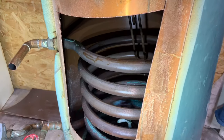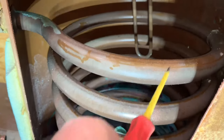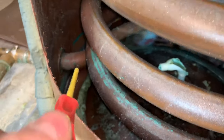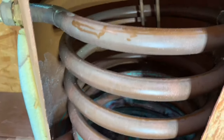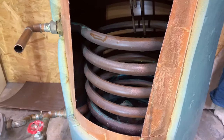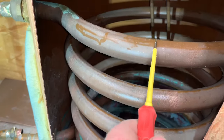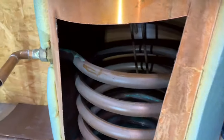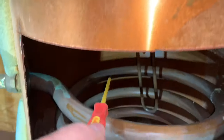I'll now cut a hole in the cylinder so you can see how that part works. The flow pipe goes into the cylinder and around the coil inside, then comes back out at the bottom as the return. This is the central heating water - you wouldn't want that to mix with the water you drink or bathe in, so it's separated. Cold water comes in at the bottom, gets heated by the coil without mixing with it, and then comes out of the top.